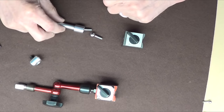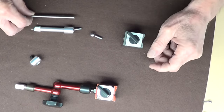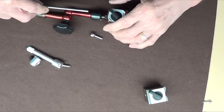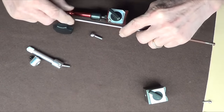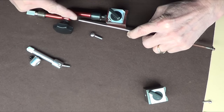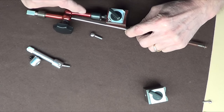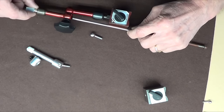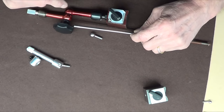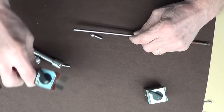Why do all that? And then you got to manufacture this rod. And somebody was asking too, how does this work? Well, they've got these rods inside, and you can see there's a bevel here. Well, this would go in this way. When you crank this knob down, there's a bevel that pushes on this bevel, which pushes this rod down and it jams on the ball. So you've got very little surface area actually adding friction to the ball to keep it from moving. So this guy's got a bevel here, this piece going through has a bevel here, and a rod, and a rod. So when you crank it down, it pushes everything apart.